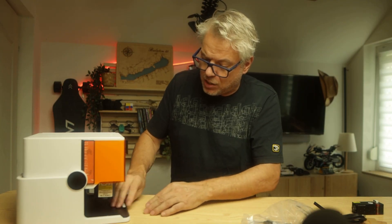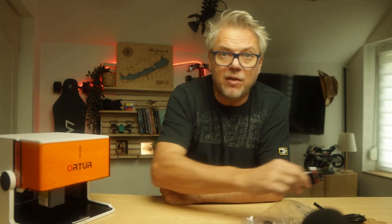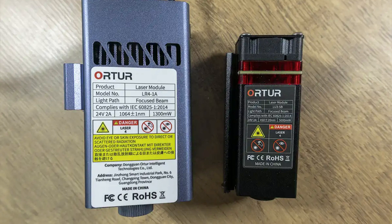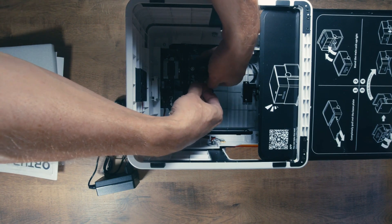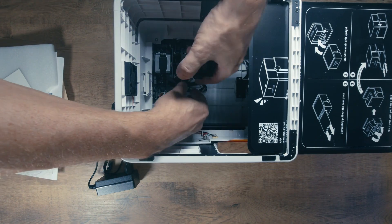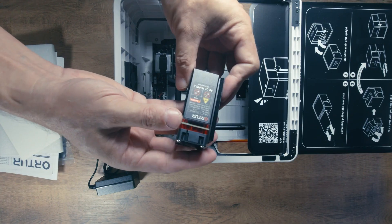As I mentioned earlier, it has a durable metal engraving head, which is specifically designed for this purpose. Here's the other head for comparison. You can buy the machine in three configurations: either with the 5-watt standard blue laser head, or with the metal engraving head, or you can buy it with both heads and swap them out. Swapping them is not too complex — an adapter simply has to be screwed onto the other head, then it can be fitted into place and you connect one cable. You can swap the head in about five minutes.